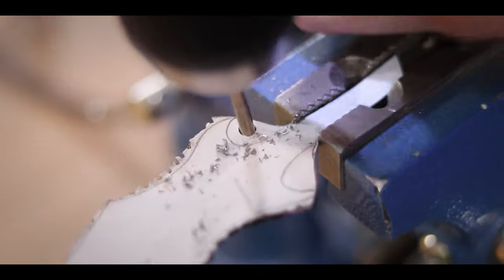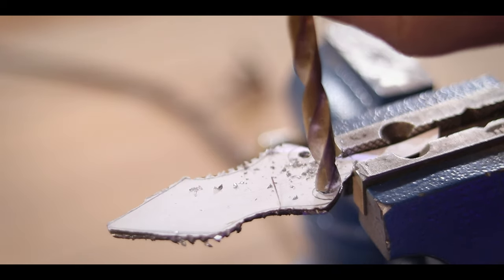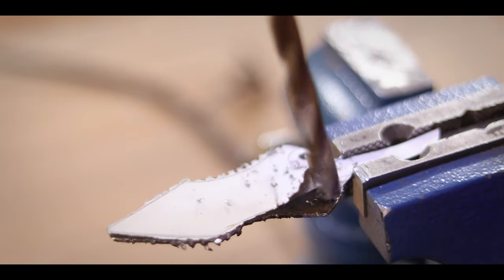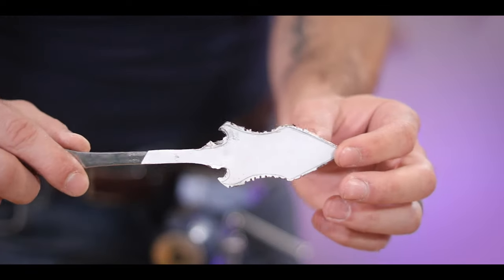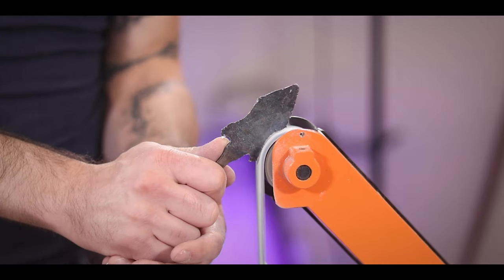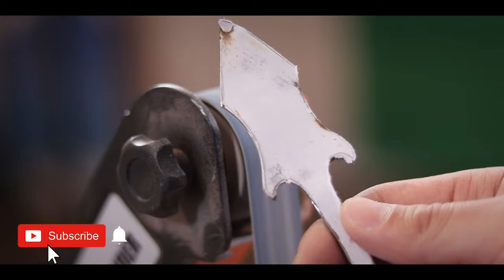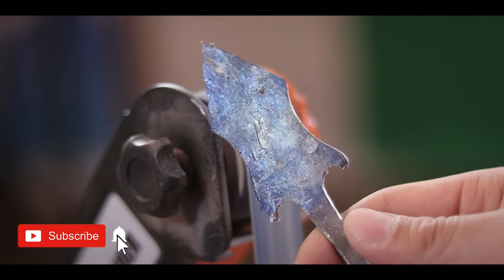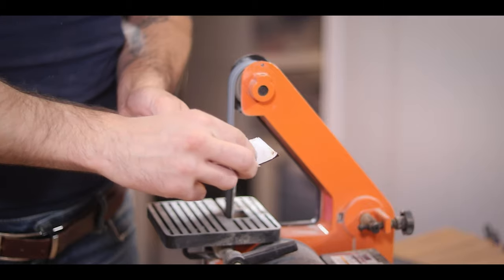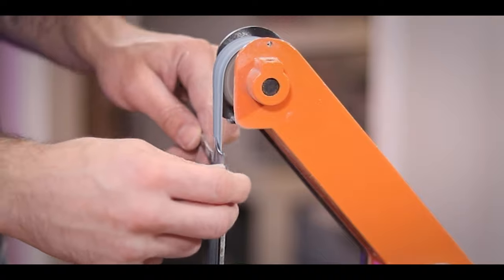For the rounded spaces underneath the barbs of the arrowhead, I started with a small drill bit to lay out my hole, then came back with a larger drill bit to get the space I wanted. This gave me a really nice roughed-out shape of what I was looking for. To refine it, I used a belt sander — the radius at the top was perfect for the little insets on the side — and I was able to get all my edges nice and smooth.